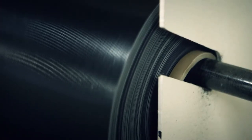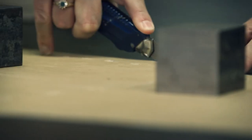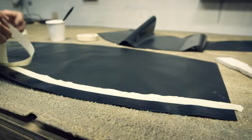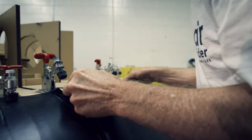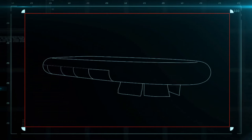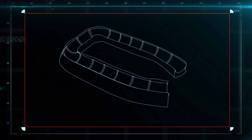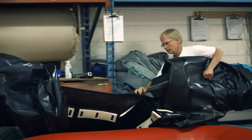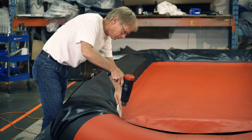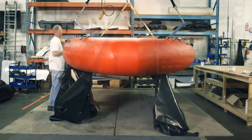To make the skirt, heavy-gauge PVC is rolled out onto a table. Using a grease pencil, the pattern is traced and cut — every piece is made to measure. Heat-activated glue is brushed onto the strips, which are stretched over a skirt-shaped wooden template. Once all the panels have been joined together, the horseshoe-shaped skirt is ready to attach to the hull. The underside has been brushed with adhesive, and the completed skirt is pressed onto the hull, then hoisted and flipped, and the skirt is wrapped around the hull and heat-sealed tight.